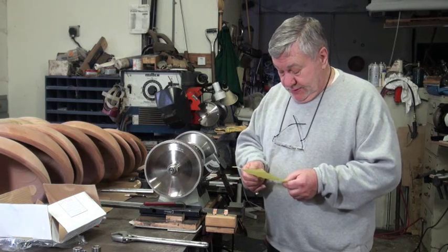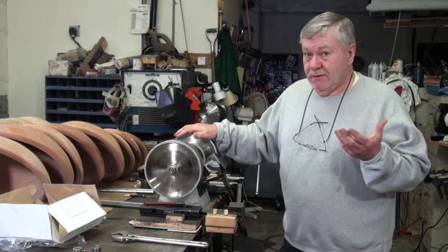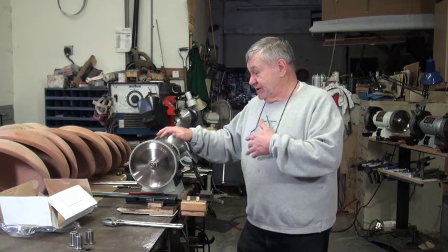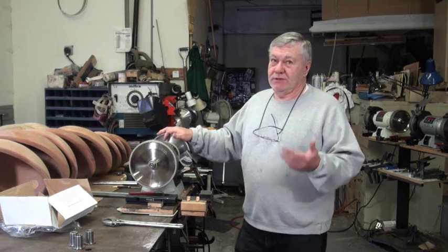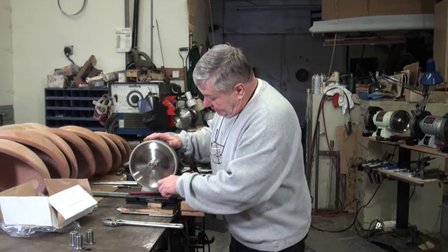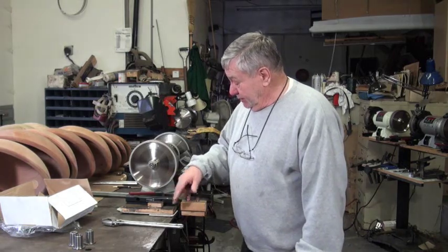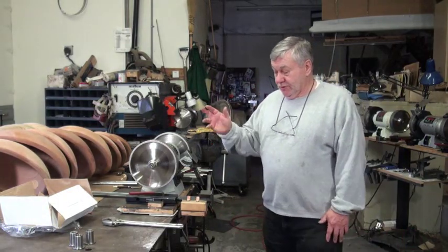As far as cleaning the wheels — you're used to dressing the regular matrix wheels — but there's really no dressing of these wheels at all. If you feel you need to clean it, you can use mineral spirits or denatured alcohol. You can take it off, put it in the sink, wash it with soap and water. I've had some that I've used for four years and never cleaned them yet. The only issue is if I'm sharpening 50 gouges, I might get a little bit of material built up right in here, and I'll just take a little rag and wipe it off. If you want to clean up around the grinder, you won't need anything but a magnet. Some people put a magnet down here to catch all the stuff. That's pretty much the story on them and how to install them.